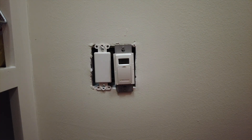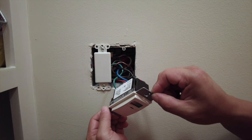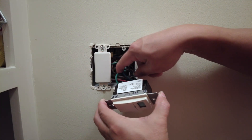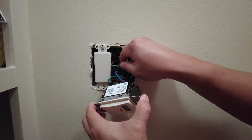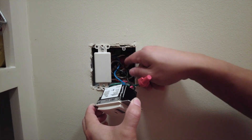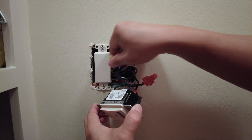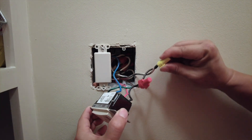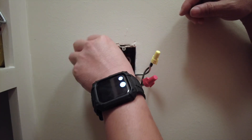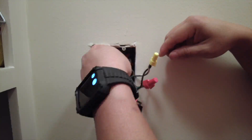After we remove the screws, you can pull the existing switch out carefully and try to pull the cable out. Many times they're actually tangled and you've got to pull it out slowly. Try not to yank it out fast, just in case something gets caught and you damage some connections — pull it out one by one. It helps also if you're wearing a glove, just in case there are some bare wires and you may get shocked.